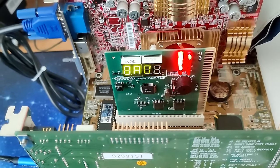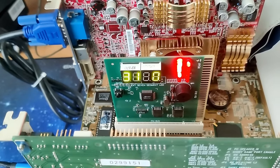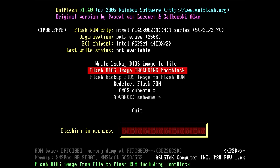And board number 5 boots! We're at 5 working motherboards, and just one more to go. Lucky me that I didn't have to replace that AGP slot. Of course, before we start testing, we need to flash the BIOS, so the board detects the Pentium 3 and we get rid of the warning from the hardware monitor.